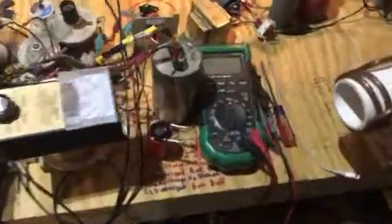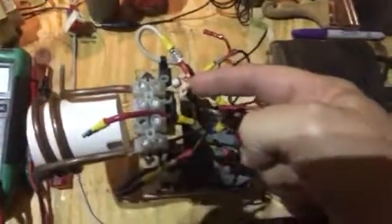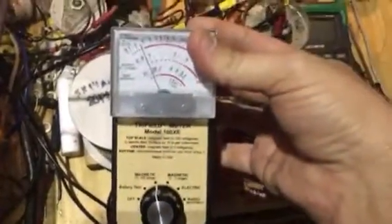Here's the magneto apparatus set up. I added this little coil in a GDT. The GDT is set to fire at 470 volts, which is just what it's rated for. The coil is small — two turns. I've got the EMF 100 meter, currently set to the magnetic setting, on a 0 to 100 gauge. It's about a foot away.